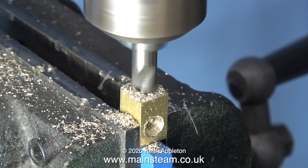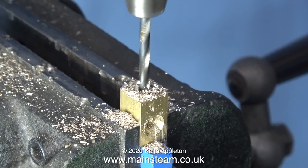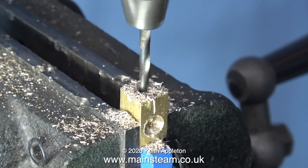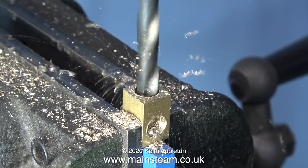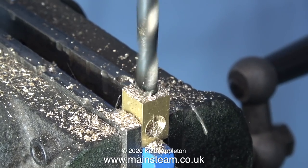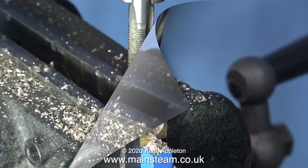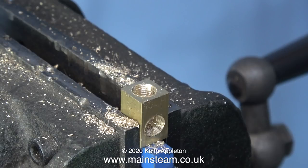The process is identical: first I use the centre drill, then a small drill — 1/8th of an inch in diameter — to go through the centre. If I used a full-size drill, there wouldn't be any thread left to mount the whistle. But I am drilling part of the way in so I can thread the hole 5/16ths by 32 threads per inch. It's a very simple and logical job, but sometimes you have to think about it — just like changing the bandsaw blade.